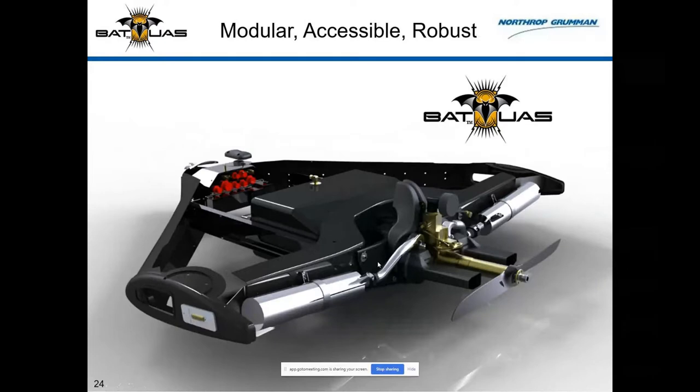Now, we're not going to be gas powered. We'll be electric. That's awesome. We still have to be very cognizant of noise. The quieter we can make the airplane, the better. And the first step to making airplanes quiet is keep the tip Mach number of your prop below 0.4. If you keep it down to 0.3 or 0.2, wow, it'll be quiet. But if you're at 0.4, you're probably doing pretty darn good.